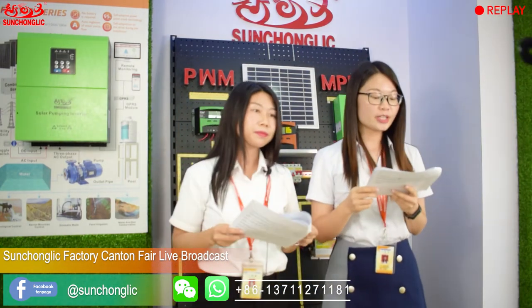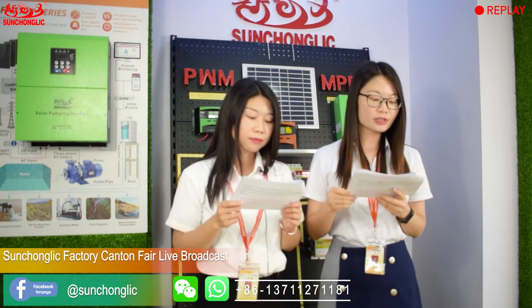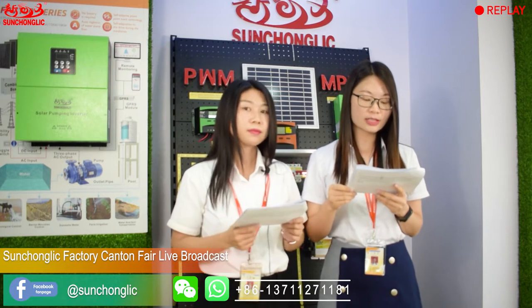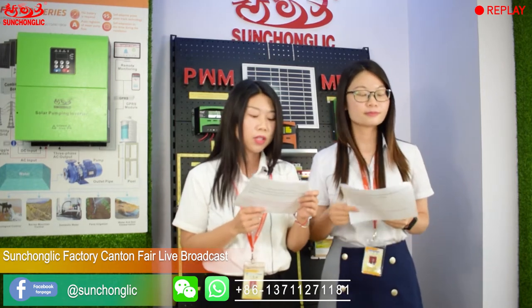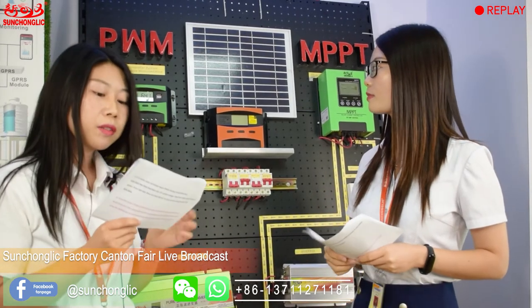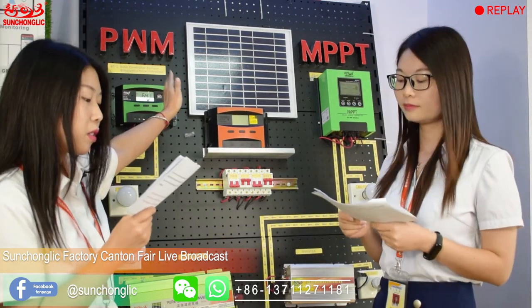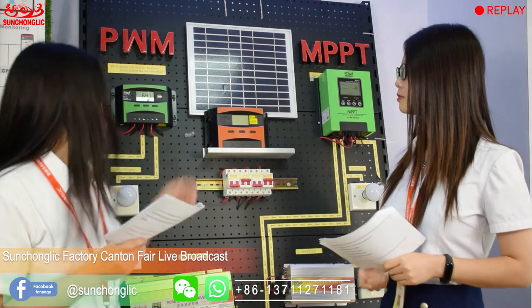This series has a handy styling design, which is convenient to install. It especially features PWM charging mode, power-off auto memory function, extreme low power consumption, reverse polarity protection, and short circuit protection. It is suitable for small power solar system products, such as solar street lights and DC load products. When installing, the solar controller must connect with the battery first so the regulator can identify the system voltage, then connect the solar panel and DC load. Pay attention to correct connections between positive and negative electrodes. This FT2C series is the Star PWM solar controller.